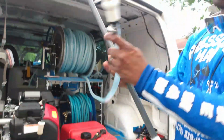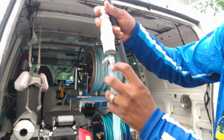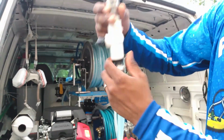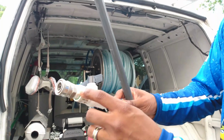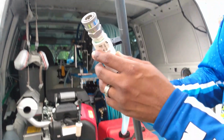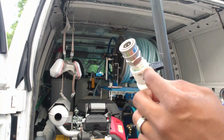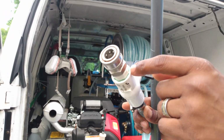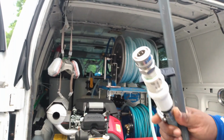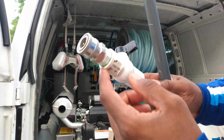So now I have here a 1/2 inch banjo hose barb. That hooks straight to the hose. Got my 1/2 inch clamp, and a 1/2 inch female threaded on both sides PVC ball valve. Home Depot, Lowe's got them. Now I got a reducing bushing here with Teflon tape around it and True Blue. When you see the True Blue turn green like that, you know some chemical got on it, because it's literally blue, but it's turned green. Don't worry, there's no leaks.